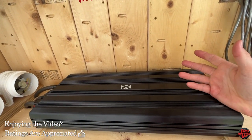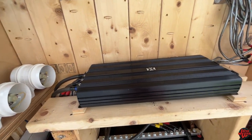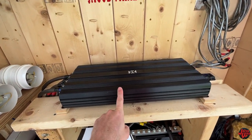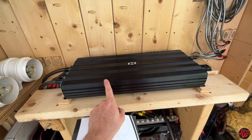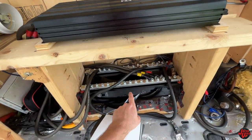I actually did an SPL test video on this on my second channel — definitely check that one out to see how much power and how much SPL score it got. I remember it was over 160; I'm not going to say the exact number, you've got to check it out. I do a lot more build and system updates on the second channel. So I have the 13.5k amp wired to one ohm. It's not going to do 13,000 watts because of my impedance rise and a little bit of voltage drop, but definitely getting my power's worth — better than 8,000, a couple thousand more watts gained.